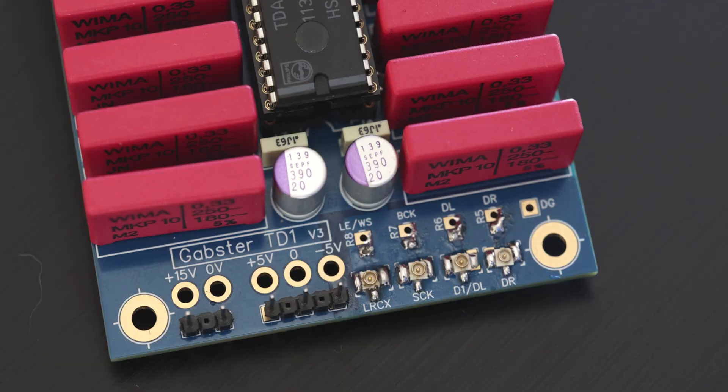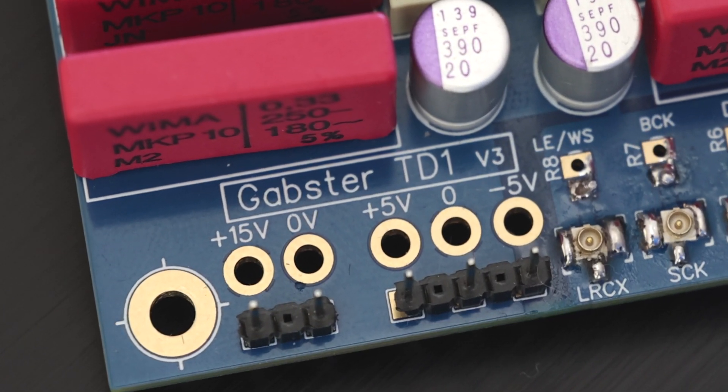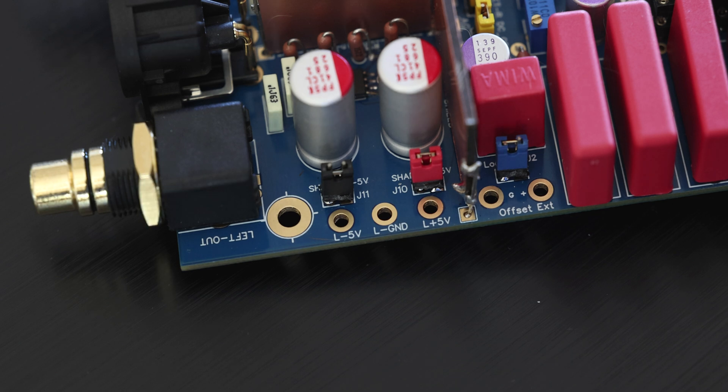You can use some very high quality parts. All the parts used are from Mouser — they're very high quality parts, and that's another thing. It's one thing to design something and then not use good parts, because parts can make or break any system. You can solder your power supply leads directly to the board to the gold-plated pads; there are some very large ones. You can accommodate up to 10 gauge wire, so that's going to keep your impedance low. I did provide some pin headers in case you're testing at the beginning and want a quick way to connect and disconnect. And if you want to run separate supplies to the digital side and the analog side, it's simple — just remove some jumpers and you have pads to connect power supply to the analog side independently from the digital side.